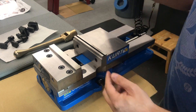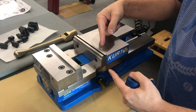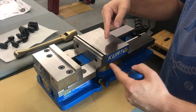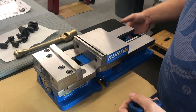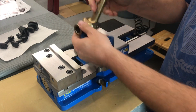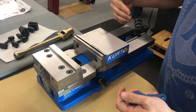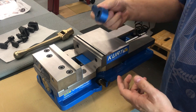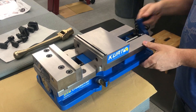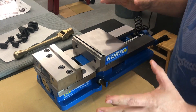This is a speed handle, and opening the vise doesn't seem like a really big deal when you're only going a couple of turns, but it can be a really big pain in the butt when the vise is on the machine and the table's in the way or the way covers are in the way. When you have to open it 6, 7, 8, 9 inches, it's going to take some time — where the speed handle just works super fast. So that's the first tip.